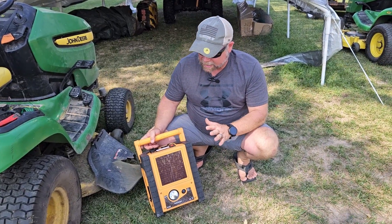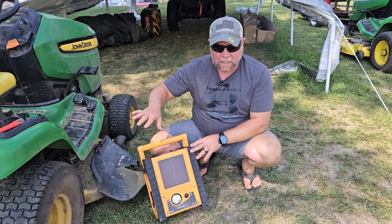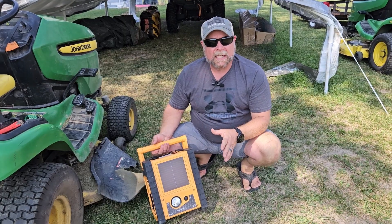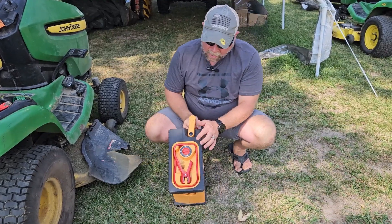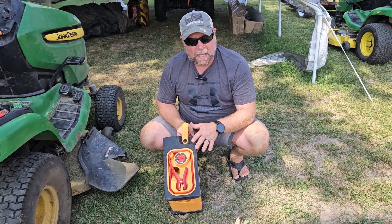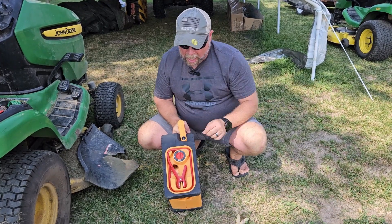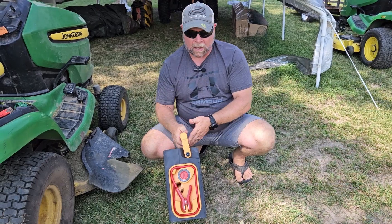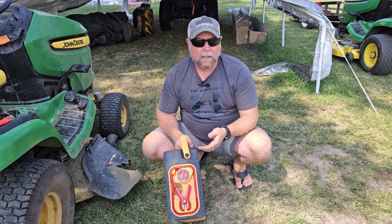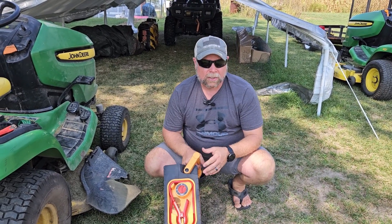This is not just good out here on the farm working on tractors and checking tires. If you happen to have a dead battery in the wintertime, you also do have a pair of jumper cables attached to this unit. All you've got to do is connect your negative to your negative terminal and your positive to your positive terminal, turn that on and you'll be ready to go. There's no buttons to push or anything like that — it'll just be connected and use the battery in this station to turn your car over.